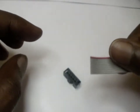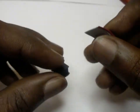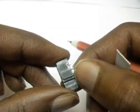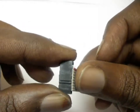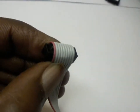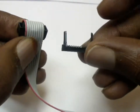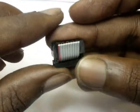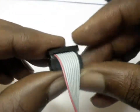Now we will start with the ribbon cable. If you see the ribbon cable, you will notice that the red stripe signifies pin number 1. Notice the relation of the arrow marker on the connector and the red stripe on the ribbon cable as I place the cable on the connector. The connector is designed so that the little teeth inside will displace the insulation and make contact with the wire. Now we are going to place the cap on the connector. This ensures that the wire is squeezed in and the insulation is ripped off, so the inside metal of the wire comes in contact with the connector.